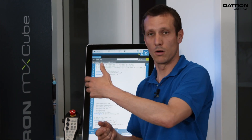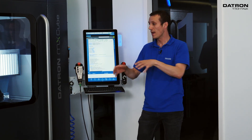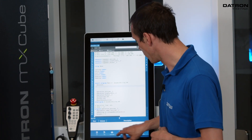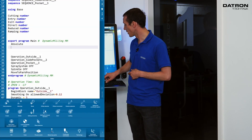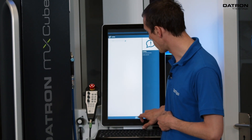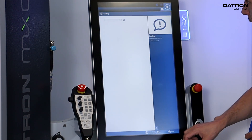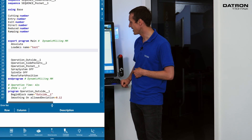That's where we need to recall the workpiece coordinate system, the WCS. We make a movement to the origin, so no matter where the spindle and tool are located, it comes to that position and measures the part, overriding the origin. First operation: I go down in the command line to 'coordinate transformation workpiece coordinate system' and select 'loading'. I can type the name or select it from the list — 'test' is active. I highlight it, click apply, hit OK, and now I have 'load WCS name test, part one'.